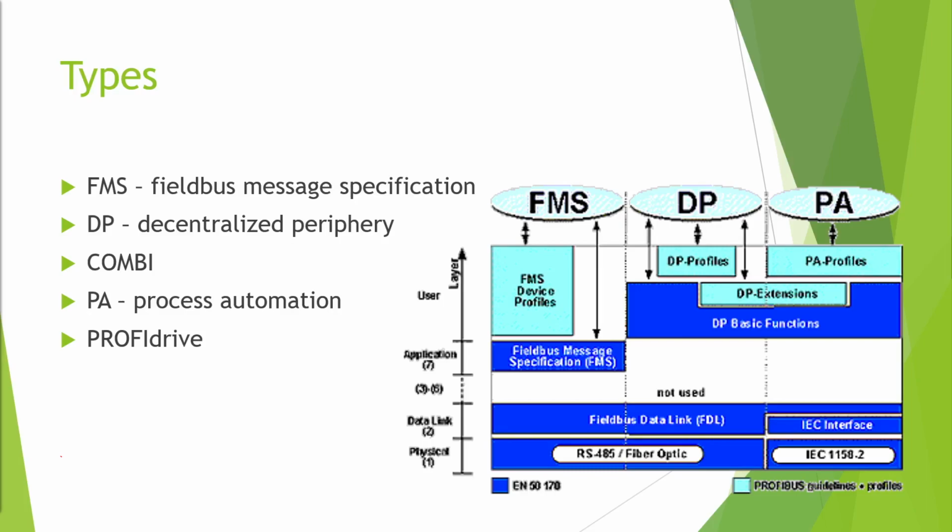A good example of this is a company, I don't think it's local. I think this was just something I was reading or watching. They had an X-ray scanner scanning their process going through. And instead of having a whole bunch of X-ray scanners set up down the line, so this one does this 1 foot wide section, the next one does the next foot, they actually had the X-ray on a conveyor that went back and forth on a track. So that would be your motion drive. They're very precisely positioning it as they're X-raying, so they know where they are at any point in time, so they know where that X-ray was taken.